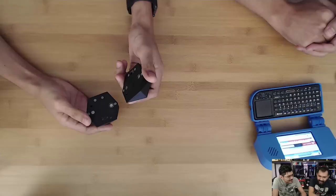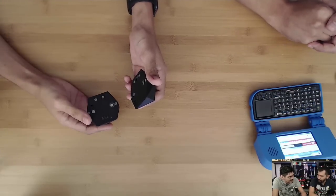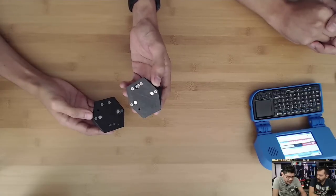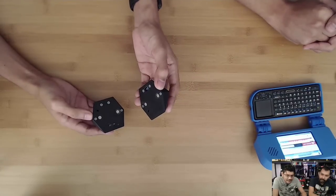Okay, it has a tilt ball switch, so it's like the poor man's accelerometer sensor thing. That's hooked up to the Adafruit sound effects board that has the amp built in, and it just has a speaker wired into it and a 500 milliamp battery. Track one. And it's a cool little prototype.